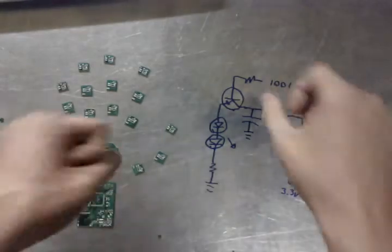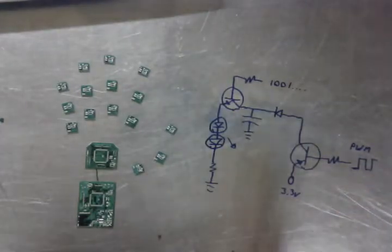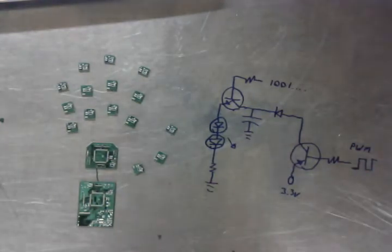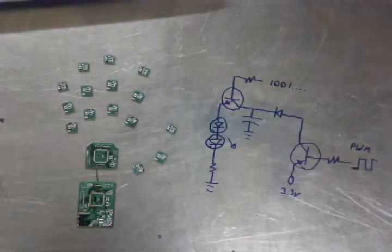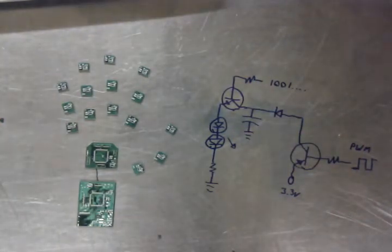so it would be nice if I was only using the IRDa peripheral to communicate glove to glove, which is the basic idea. It'll probably be one of the first use cases. Even if I was, there's no reason to scream, so why waste current doing so? So that's what that's for. But you could also potentially use it for range finding and whatnot. The actual data to be sent comes through and toggles this transistor. So that's the general idea.